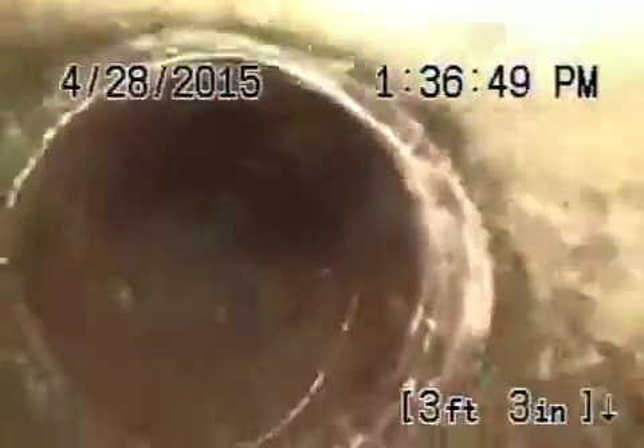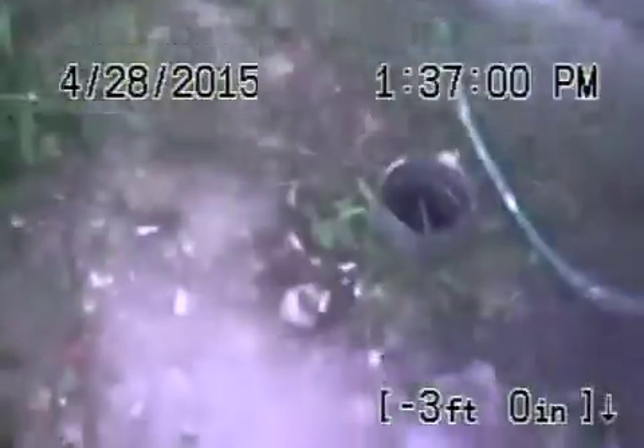The rest of the pipe could just be cleaned out into the street. I would have recommended it could have been cleaned, but because of that severe dislocation, I think we need to recommend that the pipe be replaced here in the front. So we'll go ahead and stop the recording.